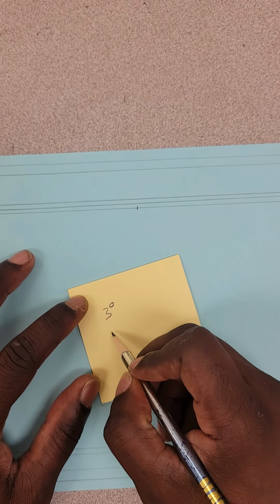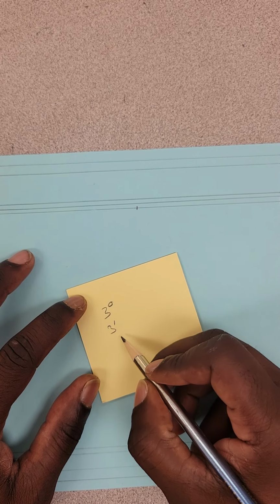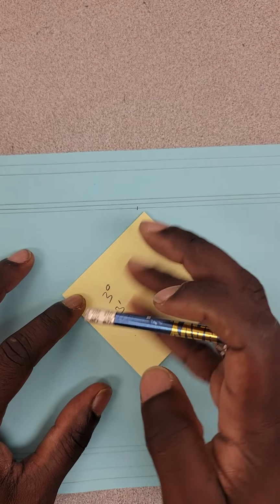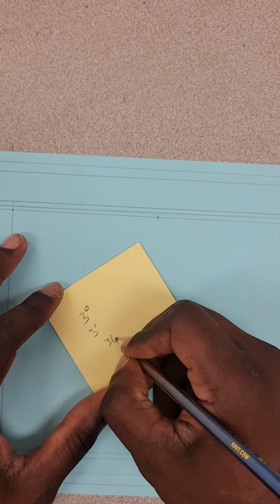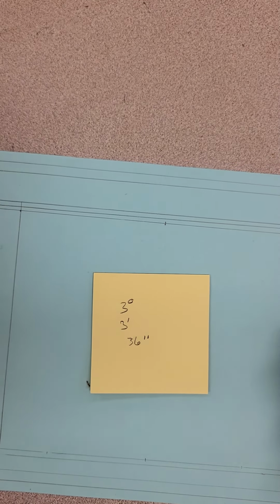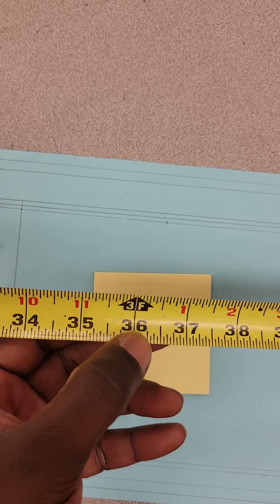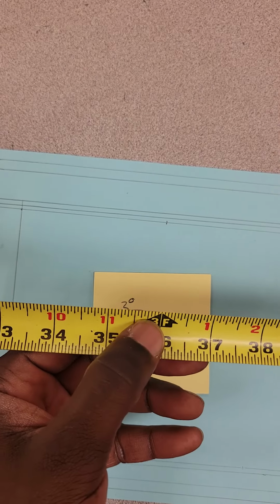It's saying that this is a 3-foot door. It's the foot sign. It says 3 feet. 3-0 is 3 feet. And you split it both ways, right? Let's see. It's 36 inches. If you look at feet, right? Let's just do it here, the example I'm talking about. 3 feet is 36 inches. That's what a 3-0 is.